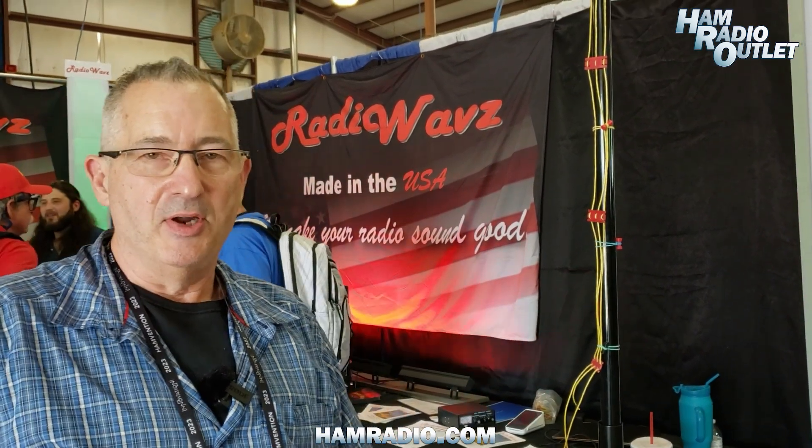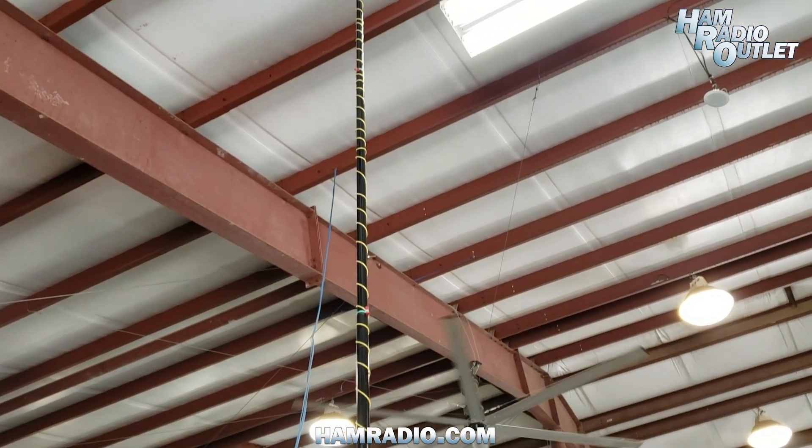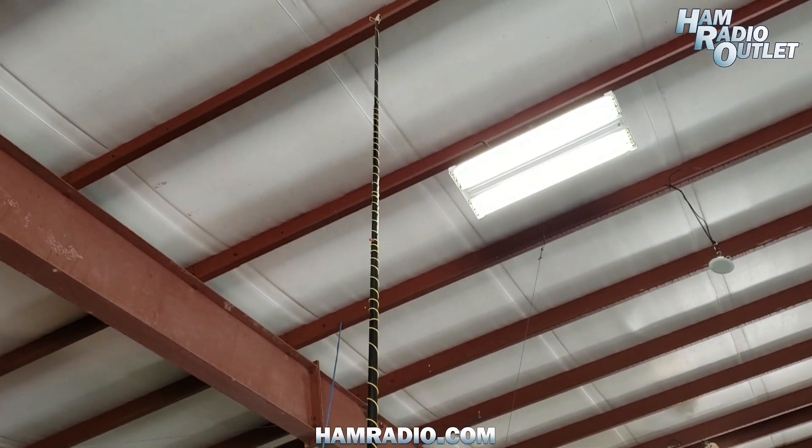To give you an idea of the advantage of this antenna over a lot of others out there — this is a vertical antenna, so it's more immune to EMI-type radiation from power lines and stuff like that, so it seems to be a quieter antenna. Plus, because it's so easy to set up and tear down, you're able to operate quite simply. It has a very low angle of radiation, so it allows for very good DX.